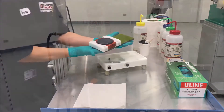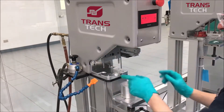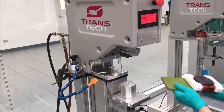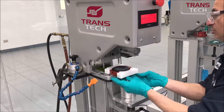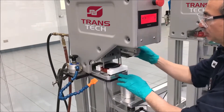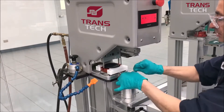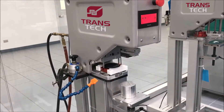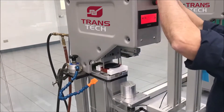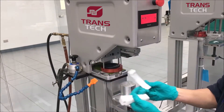Take our plate out and load it into the printer. We raised our safety guards and we're going to load the plate with the space frame into the printer. You want to make sure that we lock the plate down — this is the side cap that pushes the plate into the pins from the side and back, and this one locks it in position. Remember pressure at all times, so make sure that you put pressure on with the printer. Now we have pressure on the space frame, so I can remove my magnetic clamps that were set for the setup.